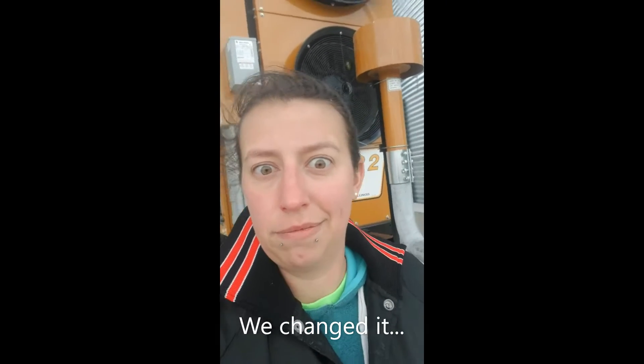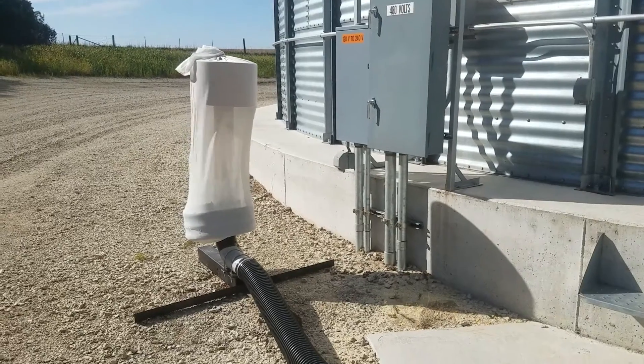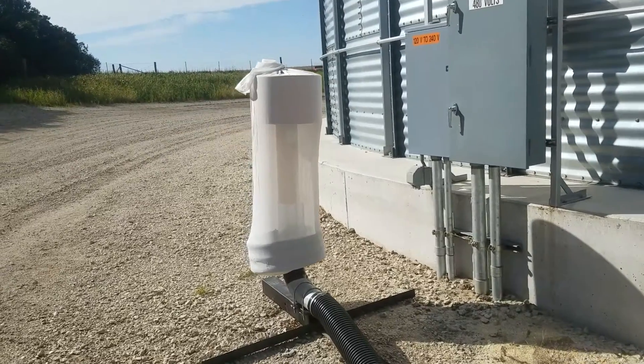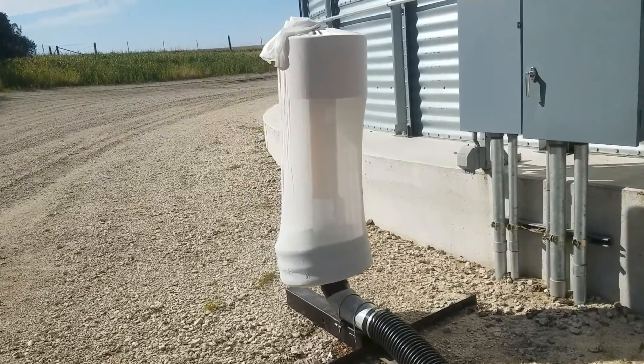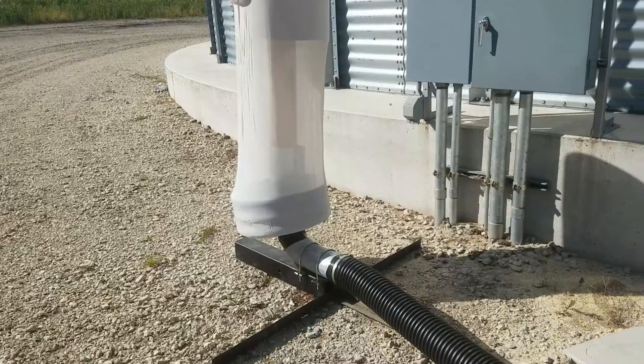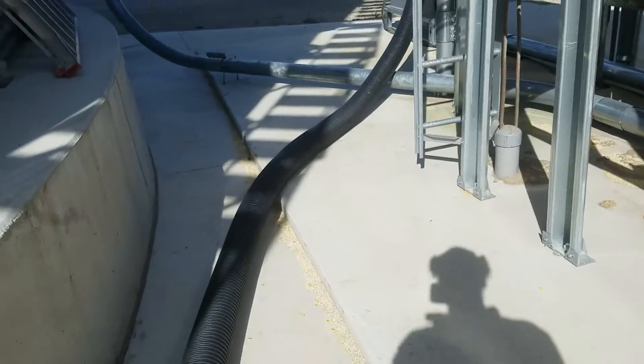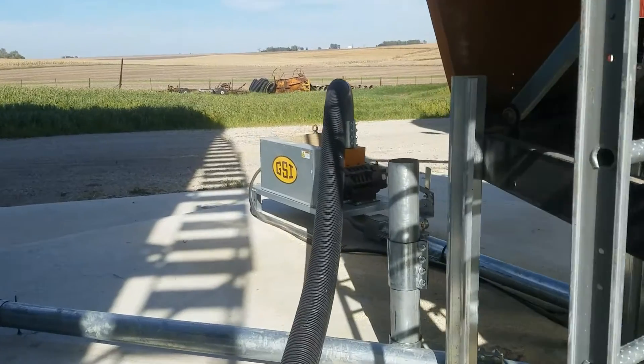This is how you beat beeswings plugging up your air filter: you remote mount it with a sock, kind of like that deal there, and then you run it with a non-perforated tile line upwind to where your blower is, so that it can always remain beeswing free.